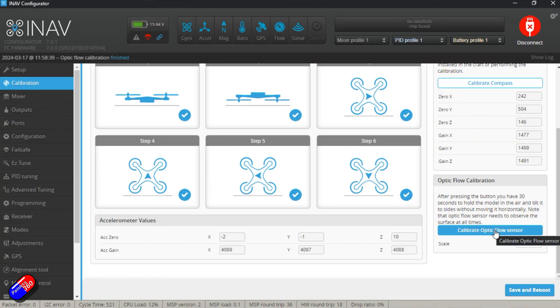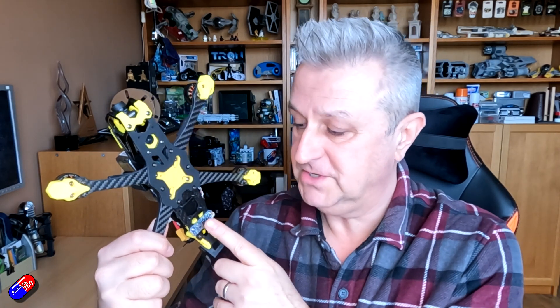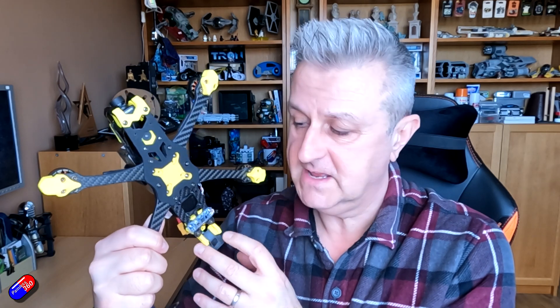With those pieces done you're in a really good place. A handful of additional pro tips: first, always have at least two centimeters clearance under the sensor when you initialize the quad - I tend to have it hanging over the edge of the box at the field. You can also turn on 'iNav allow dead reckoning', which is useful indoors if you have brief GPS outages. I'm flying this outdoors so I'm not bothering with that.